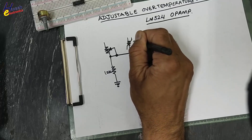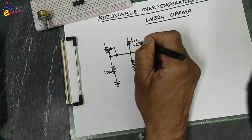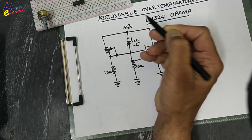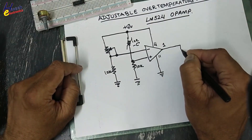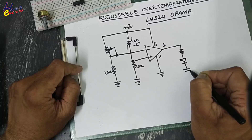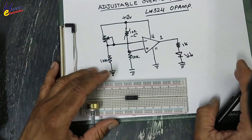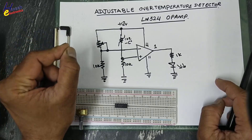The temperature sensor is a 10K ohm NTC - negative temperature coefficient - that is NTC. Our circuit is ready to monitor the output. I will connect one resistor and LED with cathode grounded and a 1K resistor. Let's build this circuit. We will apply our reference voltage here by setting this potentiometer - that is our required temperature.